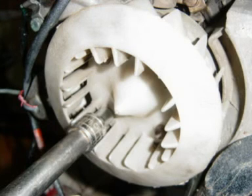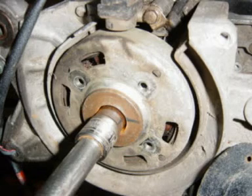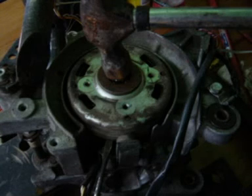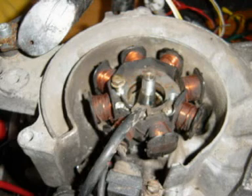Okay guys, we've got the machine built, so now we have to make some adjustments to the existing coils so we can get some useful volts. First of all, we have to remove the magneto. You can use a special little puller, or you can use a hammer to strike the shaft and prise it off with a screwdriver.